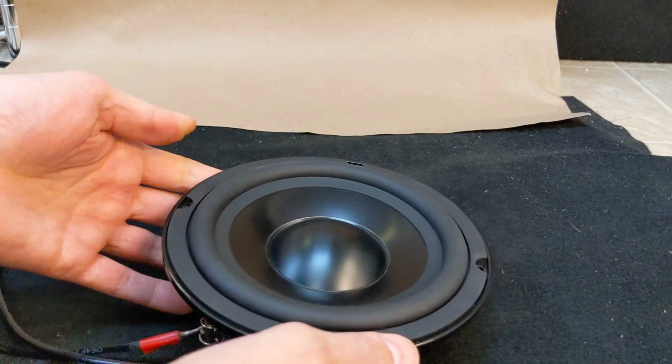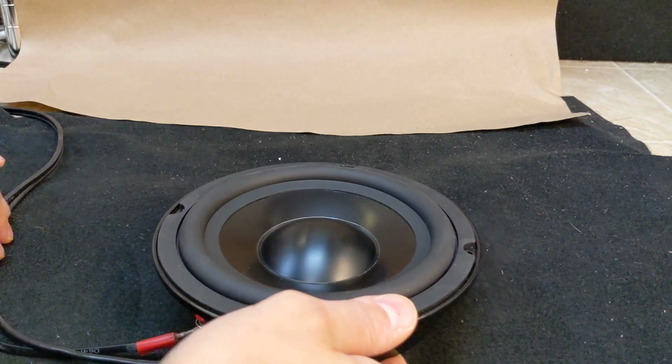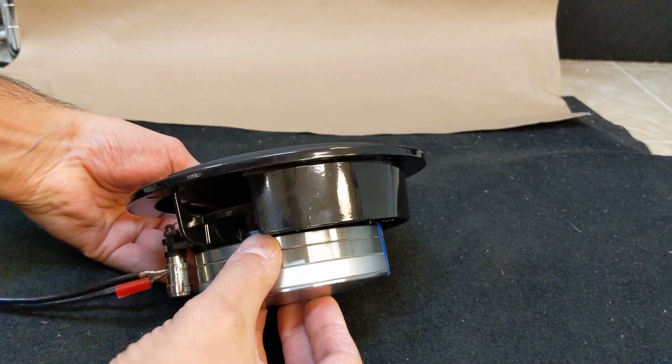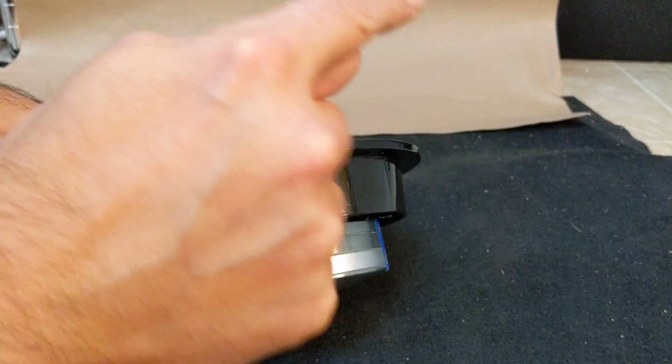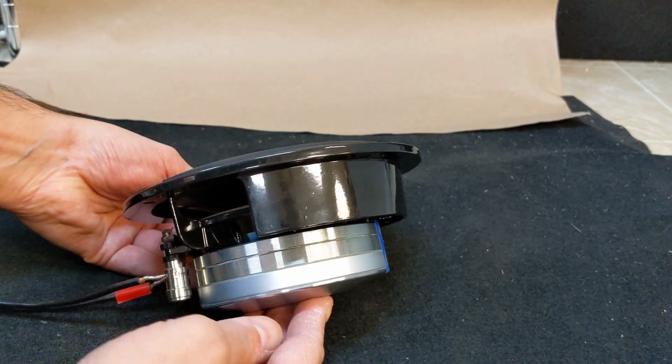So we're going to dial it back a little bit, keep the Xmax at around 70%, being around hopefully between 7 and 8, which is really close to our last one. Our last one was a little bit over 8, really close to, if not exactly, 9 millimeters. So anyway, we're going to keep everything nice and linear with it being XBL. You can see the twin top plates here. So you have a nice flat BL curve instead of one of these where it is a curve. It's a nice little plateau and then back down again.